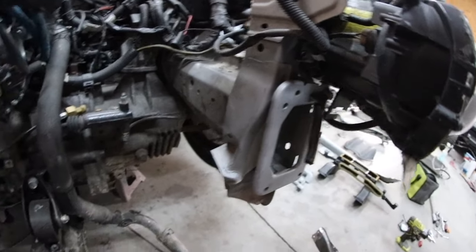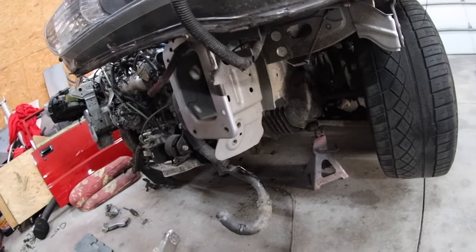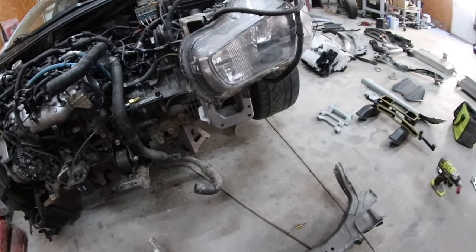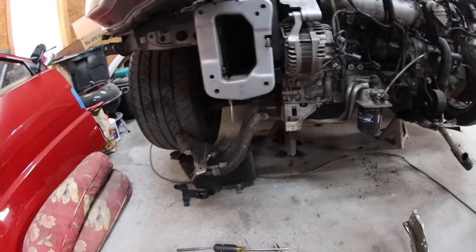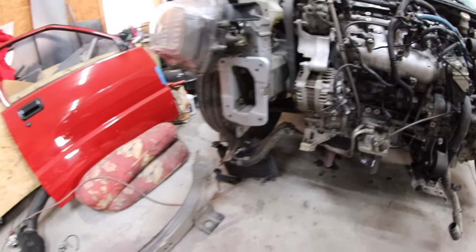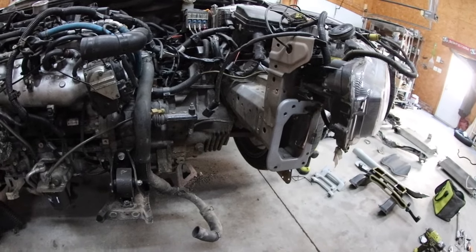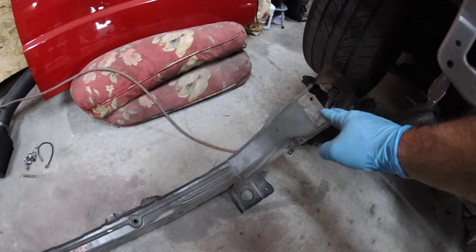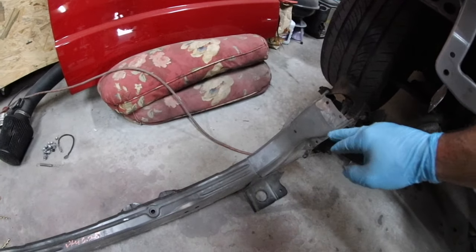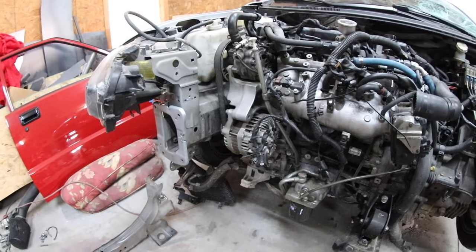Once I tack it I've got to check fitment with this bracket right here and make sure there's no pressure on that. Right now the car is on jack stands — I had to raise it so I could sit underneath and drill out the spot welds. I'll have to pull that ground wire off and drill those out. You can see where this is actually bent in a little bit, so when I drill it out I'll probably end up hitting it to get it straight. Both sides are ready. I tried to line up the core support — it's a little difficult to get up in there. I'm going to prep it first so that if I do get it to pop into place, I can just go ahead and weld it. I think a lot of the problem is this lower piece bolts up from the bottom side and it's kind of in the way. I may need to put a little inward pressure on these to get them to bow in so they'll pop in.